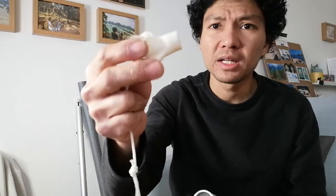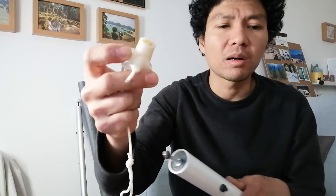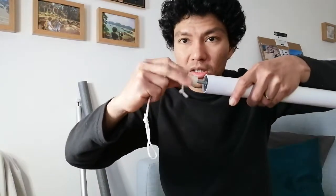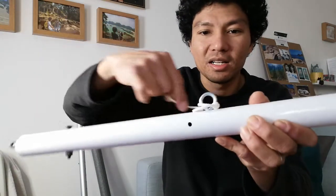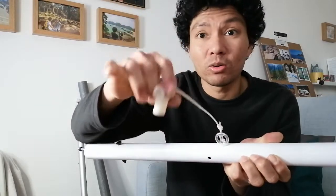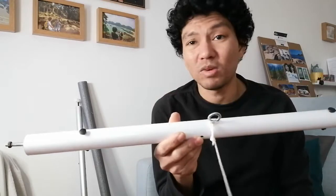Because I couldn't find a wing nut that matches this thread, I instead used a regular plastic nut I found at a plumbing store — they sell it with toilet seat covers and basin tap sets. You can use this to tighten and undo your lee boards. I drilled a small hole on the ears and passed a line through with an end-stop knot and a loop, so you can loop it over like a noose and tie it so you won't lose it. The best part is it's plastic — it will never corrode, so you can go to the beach a hundred times and it won't rot.